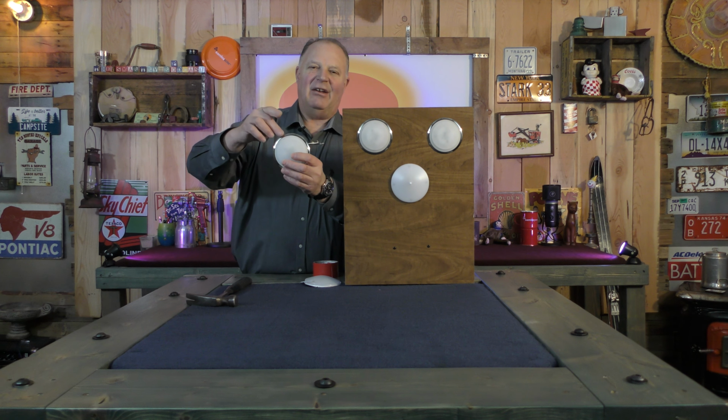Now all these lights here came out of an RV. They all have problems. They don't turn off when they're supposed to. They turn on when they're not supposed to. So the customer has his RV and he has the battery switch in the on position, but it's not plugged into shore power, so the battery's not getting charged. It's in his shop where it's not getting sunlight for the solar panel to charge the batteries. So these lights are coming on periodically throughout the day, at night. They go on for a few hours, they might turn off. It was draining his battery. So he had 7 of these lights that were killing his battery. They all had to come out.